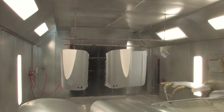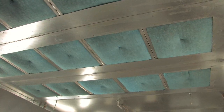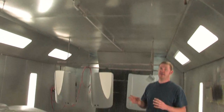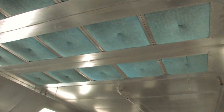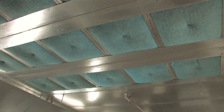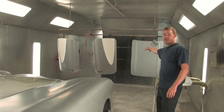There are some fairly cost-effective ways to buy a pre-manufactured paint booth — like the one behind me. It was a pre-manufactured panel system that they freight to you, and then you can assemble it and put it into your shop, assuming you have all of the requirements thought through. My paint booth is what's called a semi-down draft paint booth, which means the airflow comes through these air intake filters in the roof of the booth and then flows out through the exhaust filters at the end of the booth.